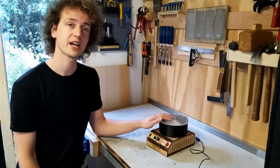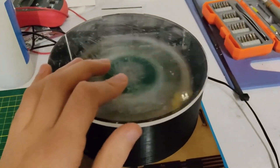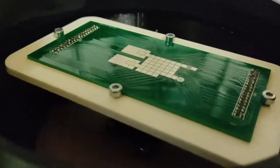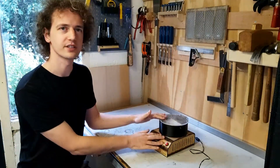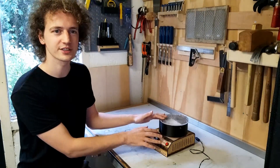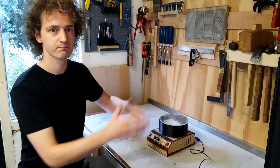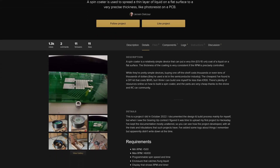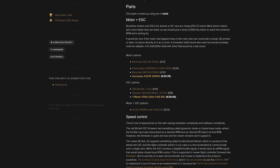All in all, I'm very happy with the result. Even using the pretty viscous Siru 40 silicone rubber, spinning at 6000 RPM for a few minutes leaves a very nice shiny layer with no visible imperfections. This is definitely a first version, and there are some improvements that come to mind: the enclosure could be stiffer, the electronics need some tidying up, and there's still some vibrations that could be dampened out. But it works! I've been using it for a number of months and it has served me well. If you'd like to create your own spin coater, there are more details on the Hackaday project page in the description below.